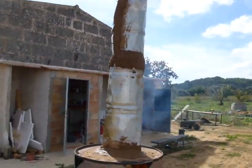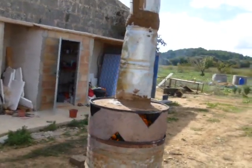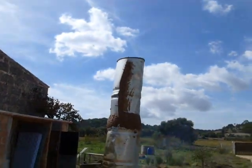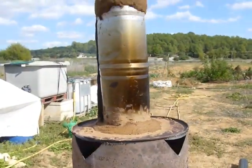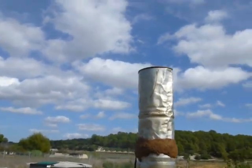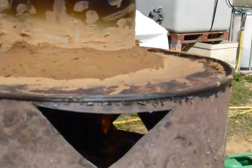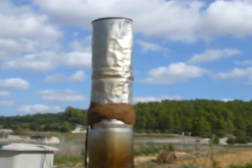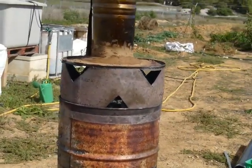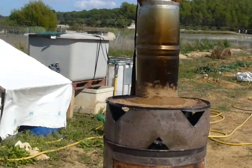It's taken me two hours to make that piece of it, just to see if it was the small chimney that was the problem. You can see it's drafting properly now — there's no smoke at the top. The smoke you can see coming off the chimney is actually from the paint burning. No smoke coming out the chimney, and you can see the flames in here. I've changed the fuel as well — I've put a load of pallet wood in there. I think that's a lot better. I just needed a bigger chimney so that it could draft properly. My Jippo chimney is working for the moment.